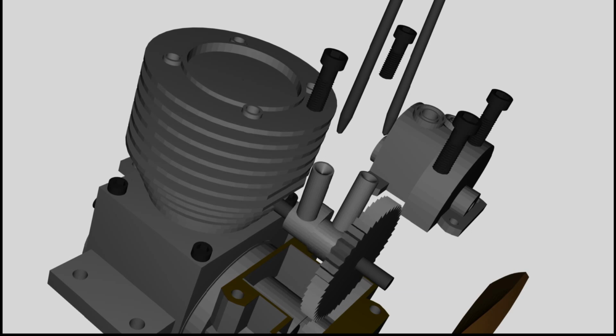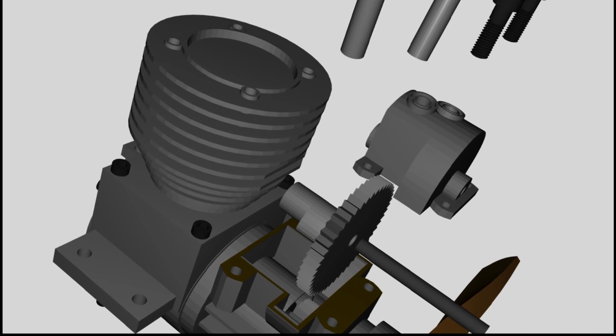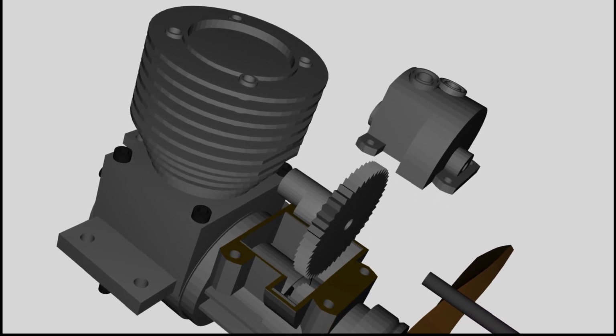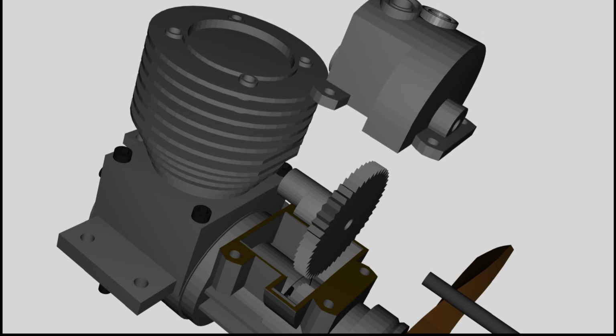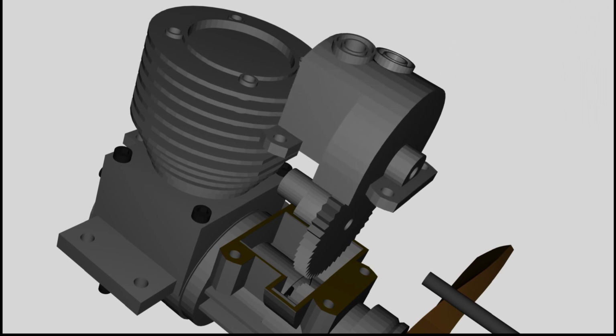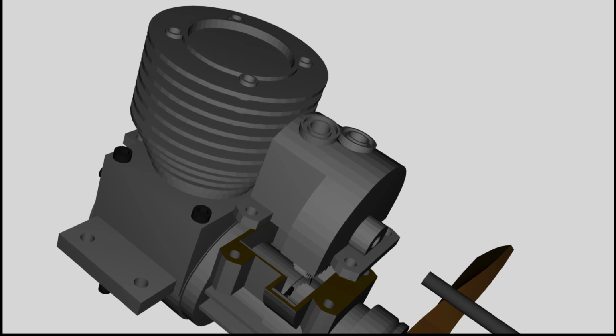The pushrods are twisting slightly during their cycles, and if they would slide directly at the cams, deep scratches would be the result. Small cylinders are used to get a large bearing surface at the cams, and so to reduce the abrasion. The whole mechanism is covered by the camshaft housing.